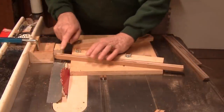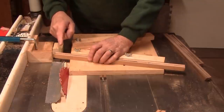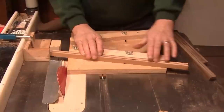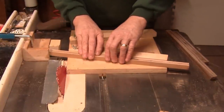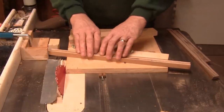Let's get going and I'll show you my little trick on trimming the end and not wasting a lot of wood. I'll go ahead and cut this piece which will be one that I'll be using. I'll bring it back, touch it against that block, and recut it — that will set it up to have the angles going the direction that I want. I have some set aside as the mirror image and I'll see if I can cut more and make a complete ring if I have enough stock.